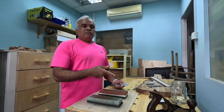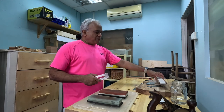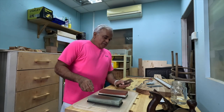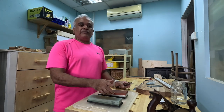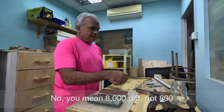I'll see you later. Before I use that plane on the sides of the fretboard, I'm going to sharpen the iron. I'll start with 1,000 grit and then move on to 3,000 and finish with 8,000, and I've got a little strop here at the end.